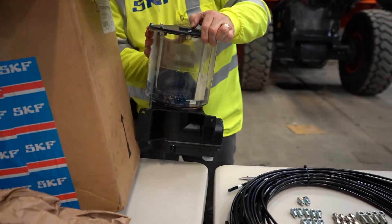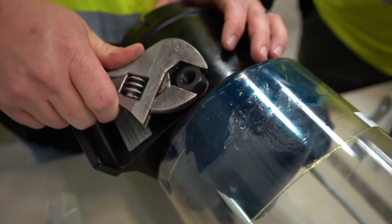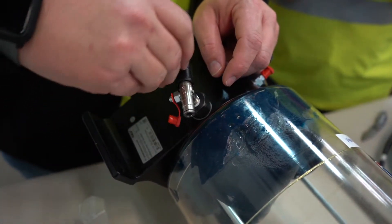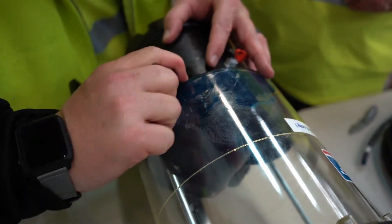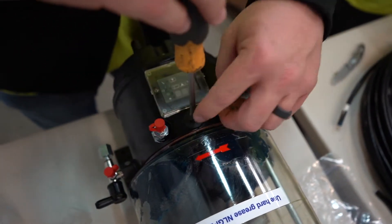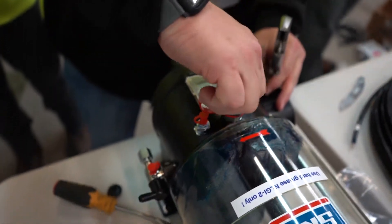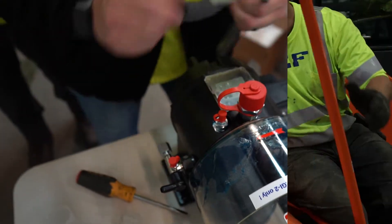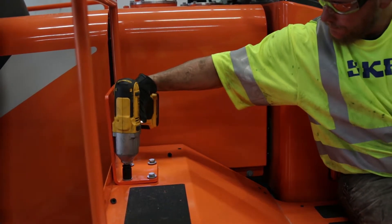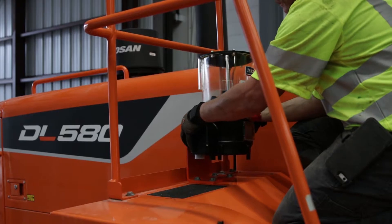With the divider valves installed, prepare the pump assembly for installation. Remove one of the plugs and install the pumping element. Next, mount the pressure relief valve to the outlet of the pumping element. Remove a secondary closure plug and install the bulk fill nipple. Mount the pump assembly adapter and pump in an easily accessible and protected location. This wheel loader has threaded mounting holes already supplied by the OEM on the right side catwalk. The location is easily visible to the operator and accessible for refilling.